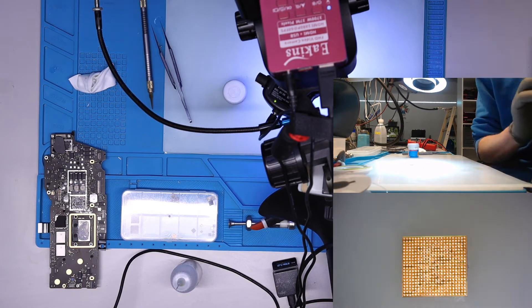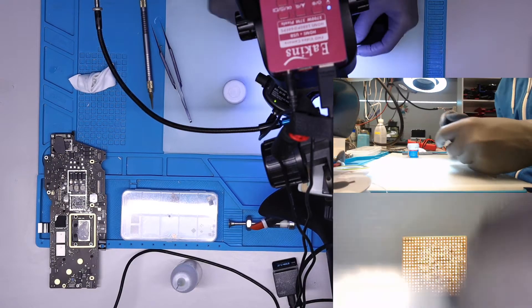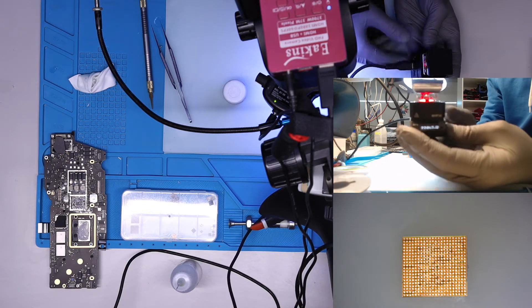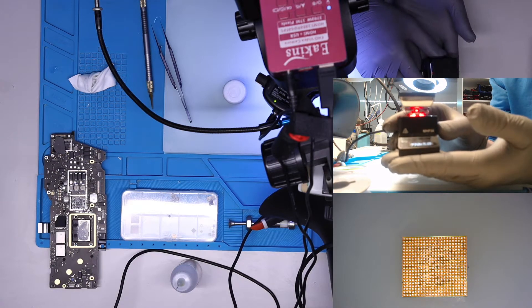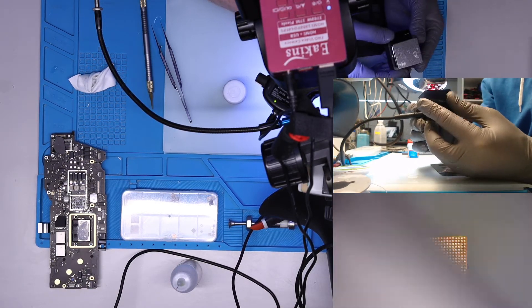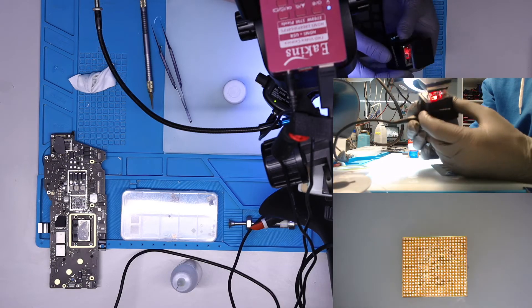What do we need? This is just a universal template, because there are no dedicated templates for this type of chip yet — there's one but I don't have it yet, I've already ordered it. The second thing you'll need is the MHP 30 mini hot plate. It's already turned on and preheated to 220 degrees. This thing has a sensor so if you rotate it, it turns itself off — very nice piece of kit.